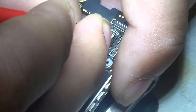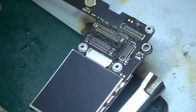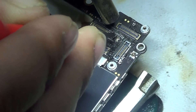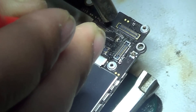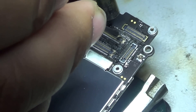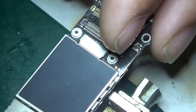I'm looking at the schematics and trying to identify the test points. With the heat gun, I'm taking off the glue from the capacitors, filters, and resistors so that the pins are visible and I can test them clearly. Once I tested them, I found that pin number two is not connected.